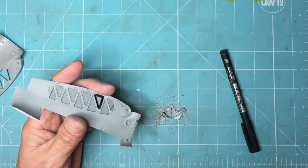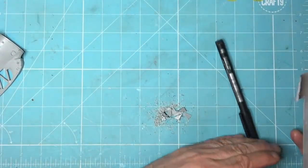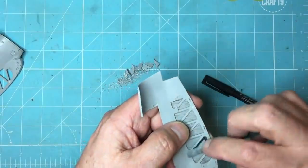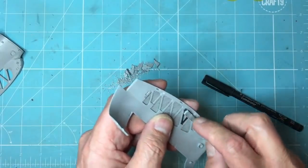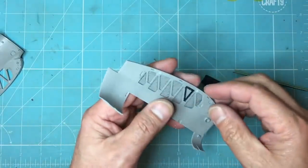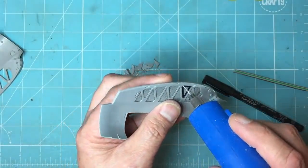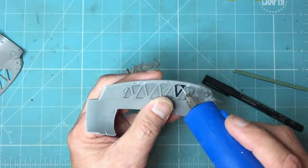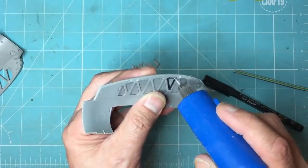Okay, one other thing I am going to do that I didn't talk about before, with a pretty worn sanding stick. Oh, this is what you get left with, so let's get that out of the way. With a pretty worn sanding stick, I'm just going to rub over so that the actual ink is only on the perpendicular face, the face that's 90 degrees to this one. And then with my drill, I can just come along and go around the outside like so, leaving a thin wall of plastic between all of the holes.